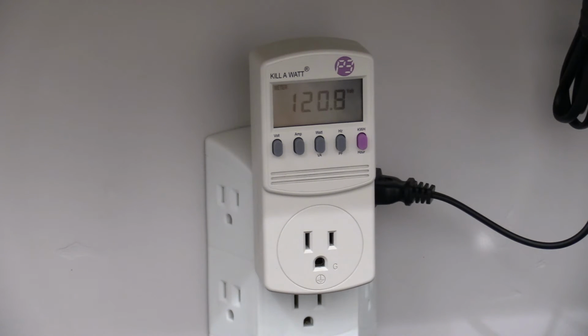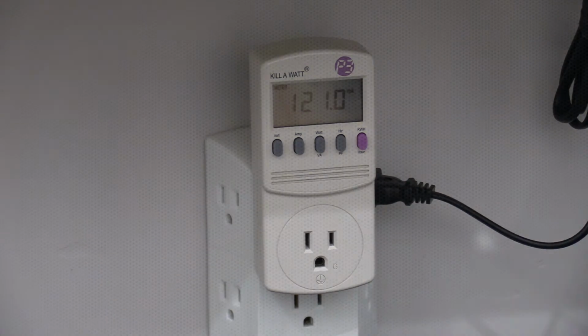However, if I run something like the TCS 1000 at the same time, the voltage drops to 106 volts or less, and if I'm running a hairdryer for drying prints, it may drop even further, which greatly annoys the UPS and causes a lot of light flickering. Therefore, I need to be careful and mindful of this while I'm doing things in the darkroom.